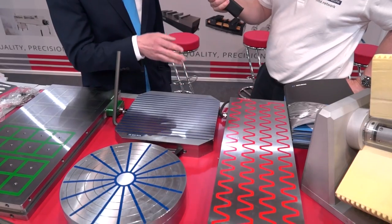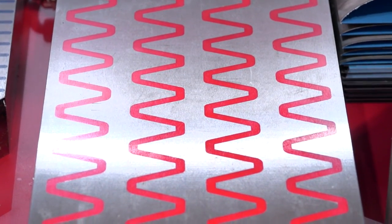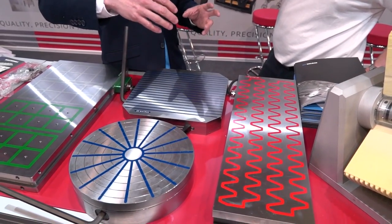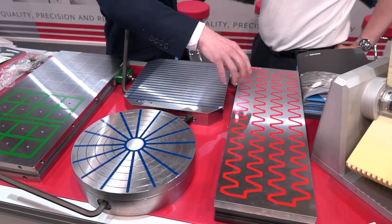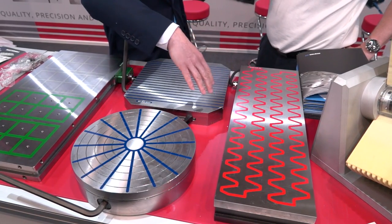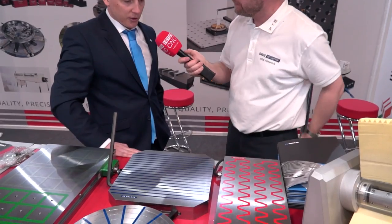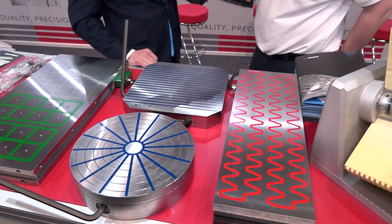This one is a magnet for grinding machines. As you can see it's not fine-poled, so it's designed for bigger workpieces. Because of the wave shape of the poles it's also designed for irregular, difficult shapes. It's quite strong — strong enough even for lighter milling, so it's good for roughing. These magnets can also be made in larger sizes and in sets for really big tables, and they can be put together as a modular system.